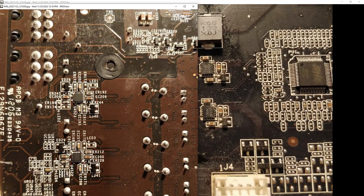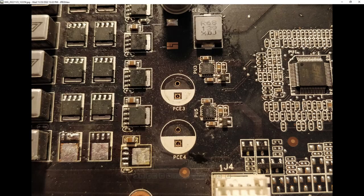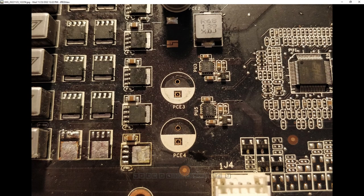Looking at the MSI card, you'll notice the passive component arrangement around these drivers is quite different, which was a bit concerning, because a one-letter difference will generally mean they should be pin-compatible — it's probably exactly the same chip with just some minor variation.